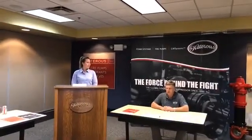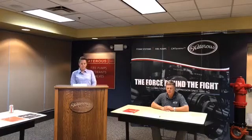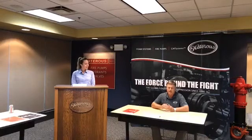One thing to keep in mind for operators: occasionally we get the question — my tank fill is closed, my pump cooling line is closed, and my tank continues to overflow. A lot of times they may look at their tank fill valve possibly having a leak. You have to remember, even at an eighth-inch hole at 150 PSI, that's allowing roughly 10 GPM to go back into the tank, so it will overfill the tank — which can be a problem in northern climates where it freezes up by where the pump operator stands.